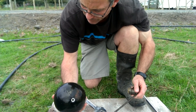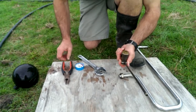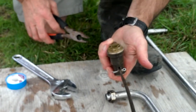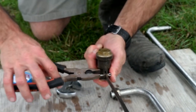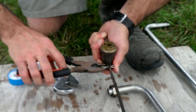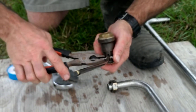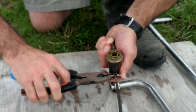If the ball is cracked, we have to change it. Then we take the arm off. To get the arm off, we need to take the split pin out. The easiest way to take the split pin out is to hold it like this — put your thumb on the split pin, get your pliers right down, bite it tight, and make sure that split pin is nice and straight.